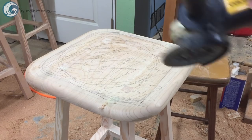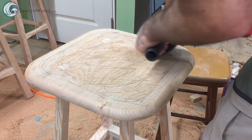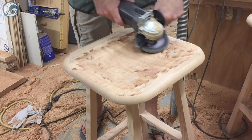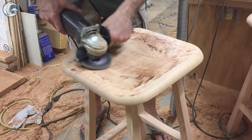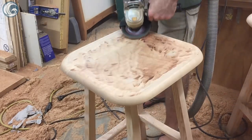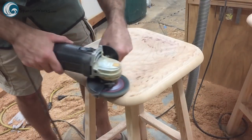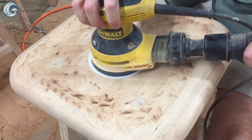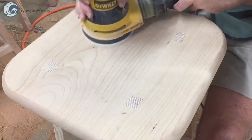When the seat has reached the depth and width you want to sculpt to, switch to a 40 grit sanding flap disc in the angle grinder and give the stool a good once-over. I keep the grinder moving quickly, first moving in one direction and then going perpendicular to that and finally diagonally to the first two passes. This removes any high spots from the sculpting step. Lastly, I use the orbital sander, sanding with 60 grit paper to clean the surface some more and then finish off with 220 grit.